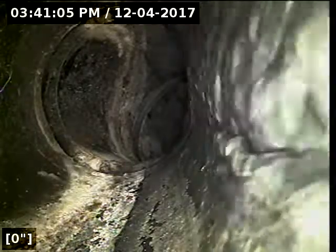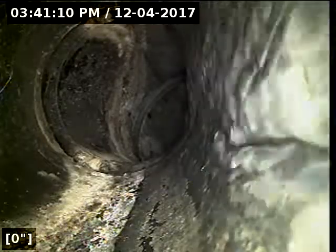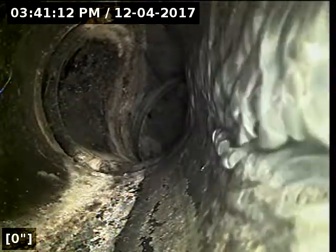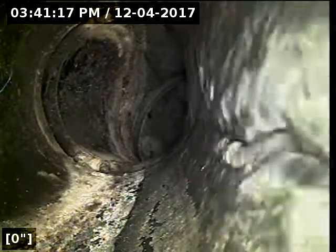It does not have a cap on it. It looks like when the deck was put in, they chopped the top of it off. It's still down here, but they never replaced the cap. So I would recommend installing a flange and cap on this. You'll probably have to cut the cleanout a little shorter, but that would be ideal anyway.